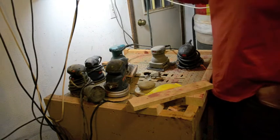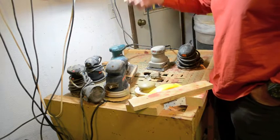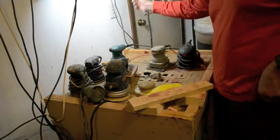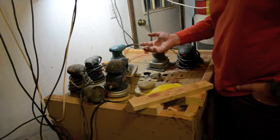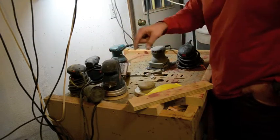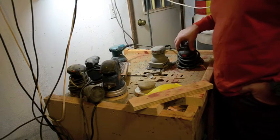The other piece I wanted to mention is that you need really good lighting when you're sanding. I've got lights above me, a shop light above me, and I've also got a light here that'll highlight any scratches in the grain. I also position this table specifically to be close to the outdoors, so now I've got three different sources of light — the shop lights, this light, and the outdoor light — so I can see any fine scratches on the work as I'm sanding. With the orbital sander, if you've got a little scratch on the paper, it'll make little zings all over the place. That's why with three sources of light you can really see the work very well and understand how far along you are with the sanding.